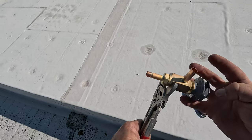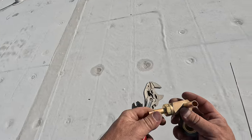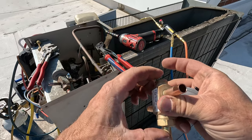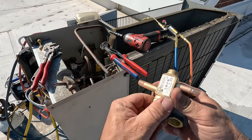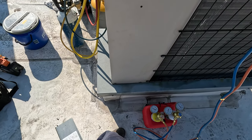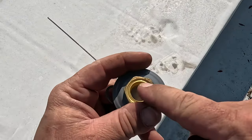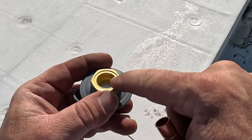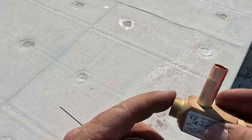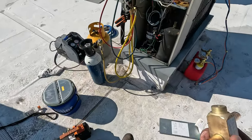We'll put a little oil on that one and put it back together. That's about all I'm going to take apart. I'll wrap it with a wet rag and yank it out — no big deal. All it is in there is a spring — it pushes down with the head and then the pressure on the other side pushes up. That's how she works. As you can see, it's got little edges cut into it — that's why you don't need to over-tighten it. It's a nice brass fit. It's not sealing on the threads; it's actually sealing on the body. That's why you don't want to get too stupid tight with it.